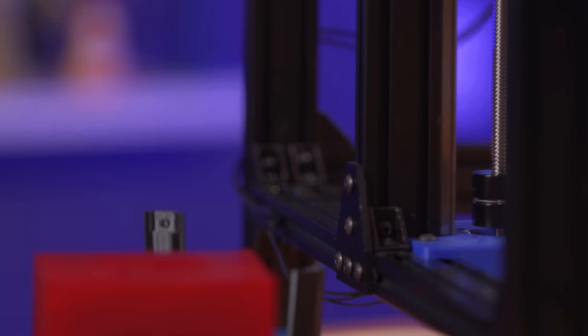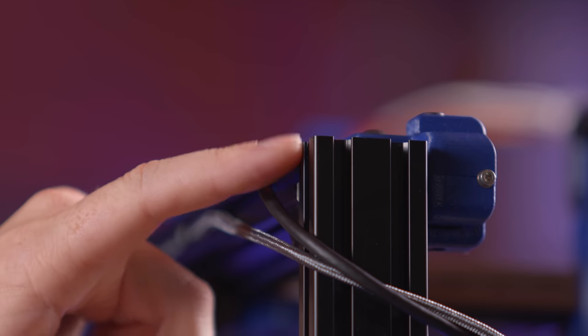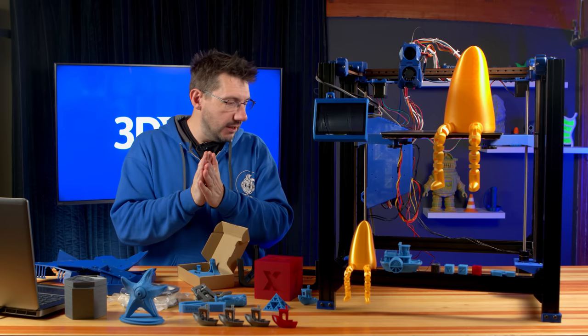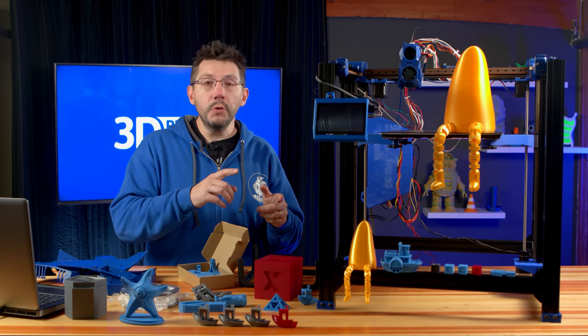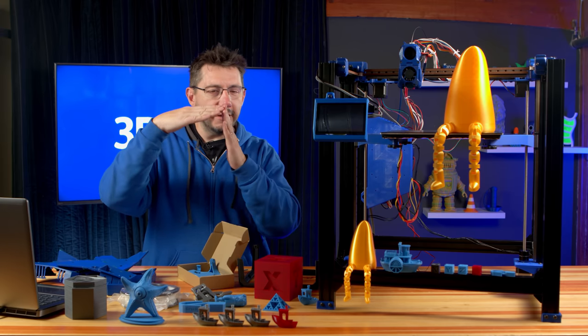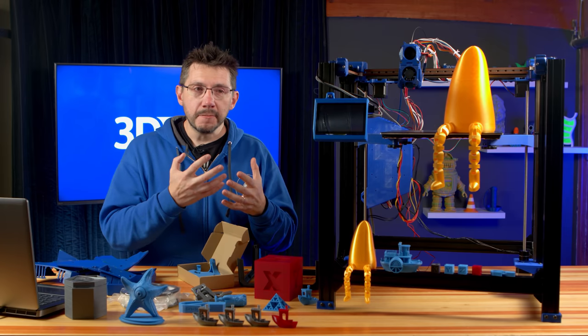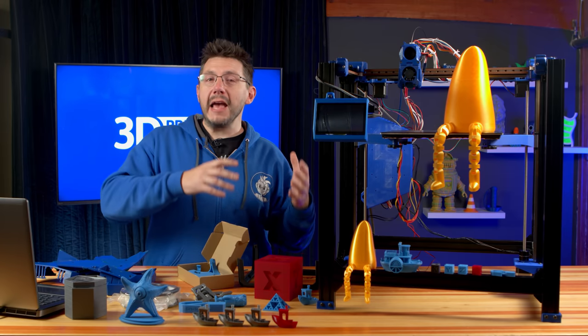If you look at the extrusions on the machine, there are an awful lot of corner brackets, and it really doesn't lend itself to putting things together in an easy way to make the frame square. In fact, back here I can tell it's just a few millimeters low, and up top it's a few millimeters high. If production were to happen — Max, I'm speaking to you — rather than using a whole bunch of corner brackets, what I would do is screw into the extrusions. You can tap and drill the holes and use long screws to hold the extrusions in, and that will guarantee you the closest to 90 degrees you're probably going to get. It will also sturdy up that frame without having to worry about corner brackets. If you're shipping it fully assembled, that means there are that many more attachments that need to be verified as square by your customer.